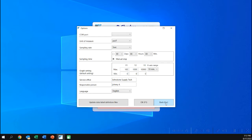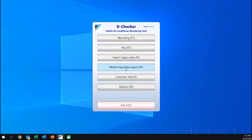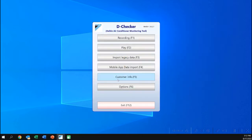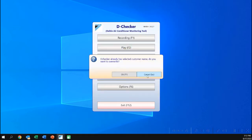When I look at the COM port in Options and I don't see a COM port to choose from, my drivers aren't loaded. I can go to Device Manager and see what's going on. We'll also load the service person name. There are a few screen jumps here where I edited a bit — you'll see me go in and do a mobile data import.